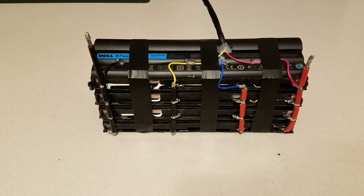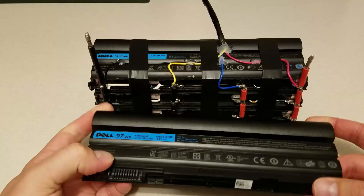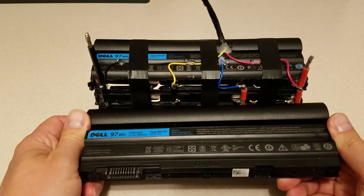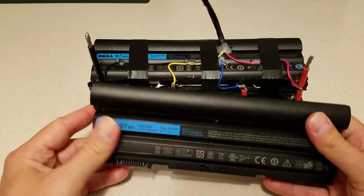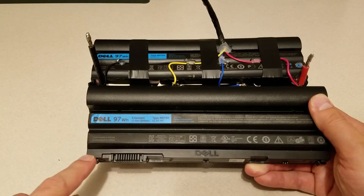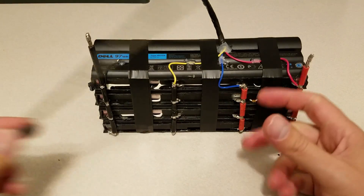This is my custom-built lithium-ion battery. I wanted to find something that was pretty modular, easy to modify, and fairly safe to do. I was looking on eBay and found a listing of these Dell laptop batteries — high-capacity lithium-ion 18650s. The pack itself is a 3S battery, so three batteries in series with three in parallel. I opened one up and revealed a control board along the edge that was soldered directly into the charging leads of each battery. I took an oscillating saw and cut carefully along that edge, which revealed the control board.